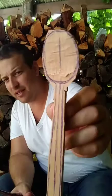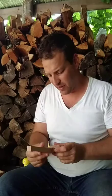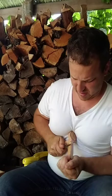You can see that with my spoon blank, I leave a fair amount of material there. That's because it's easy enough to remove with the knife — it takes less than a minute to trim to the line with the knife, and the risk of ruining a spoon blank by pushing the axe too far is significant. So I tend to stay a millimeter or two away from the line I've drawn.